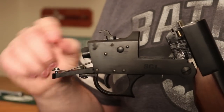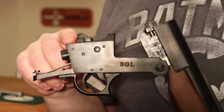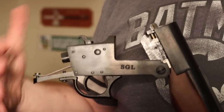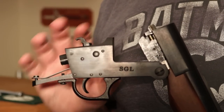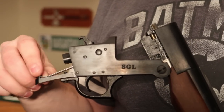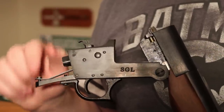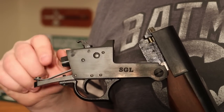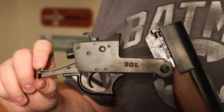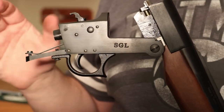The way to do this is you're going to have to play with it. Take the gun, try your favorite brand of 12 gauge ammo, try multiple brands. In my case everything seemed to work fine with my settings and the trigger is nice and light. Once you've trial-and-errored — take the stock off, adjust it, try shooting — once you're getting reliable ignition and the trigger feels light enough that you're comfortable with it, just stop there. Put some loctite on this screw where you had it and you should be good to go. The advantage of using removable loctite is you can always adjust it later.